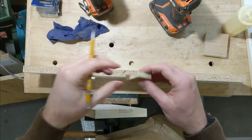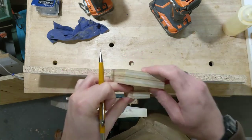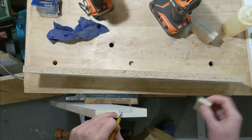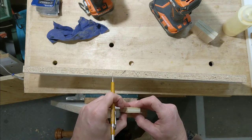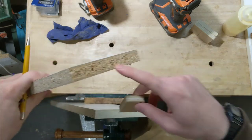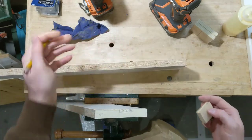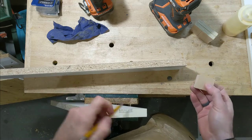The block for the back side of the stop block — the one that slides inside the slot — is just under a half inch thick. I need to make a cut on both boards that's an eighth inch deep, removing material across a specific width, because I have to do the same thing on the other board mirrored. I can do both boards at the same time with multiple passes, moving the fence little by little to create the slot.